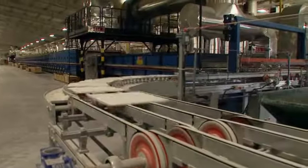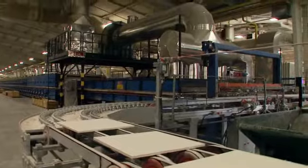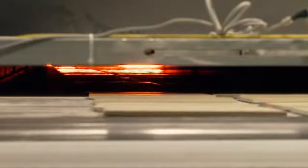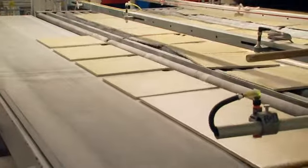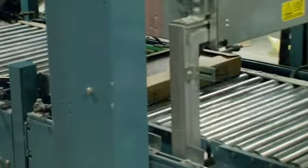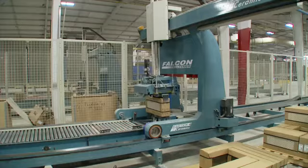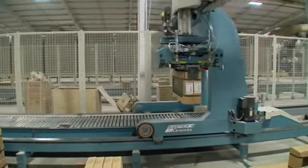After the decorating of the tile, the tile is ready to go to the kiln for firing. In the firing process, that's where the tile gets its final strength and the glaze hardens over to its glassy form. Then the tile is ready for selection and packaging and ready to go to the customer. When the tile products are finished, they're measured by lasers and inspected for visual defects. Automatic packaging machines take care of the packaging and sorting, and then the product is ready to ship all over the country.